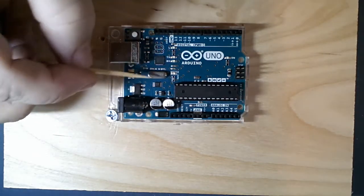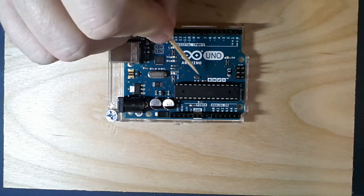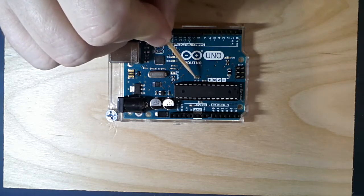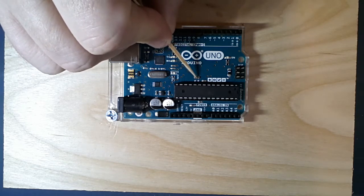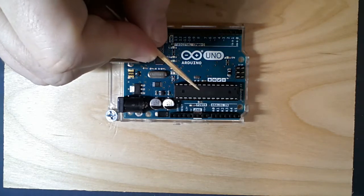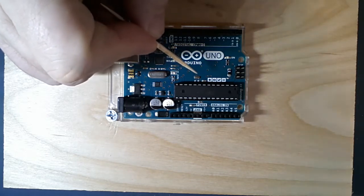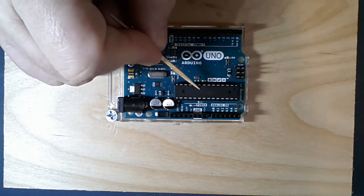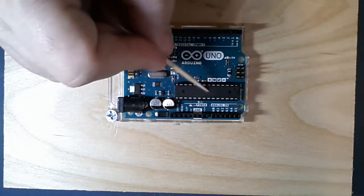This is a crystal which makes an oscillator for the USB adapter, and right here is a tiny oscillator or crystal for the microcontroller. What a crystal oscillator does is create a clock - a signal that goes high and low, zero and five volts, millions of times a second - in the megahertz range. That is the heartbeat for the controller. The microcontroller uses the clock to control all its internal logic; everything is built on a clock.